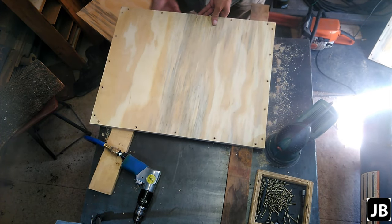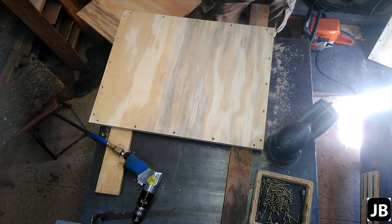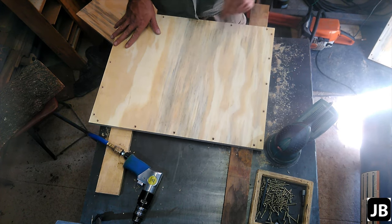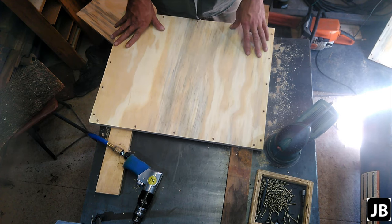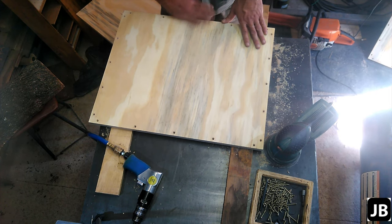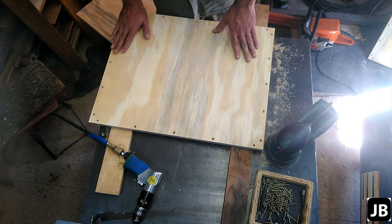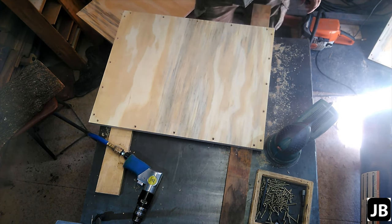You'll see I'm not sanding it mirror flat. We're not going to do a French polish on it. The lady of the house still wants a bit of a rustic feel to it. That's partly why we use the shutter ply. It's not marine grade ply, it's actually cheap. That's the second reason, it's because of the price. So I'm not going to be too worried about getting it absolutely flat, because it's bad wood. It's not A grade to start with. So we just want to get all the pad marks out, pencil marks off, etc. And that'll be enough.